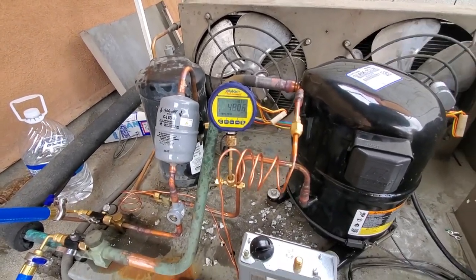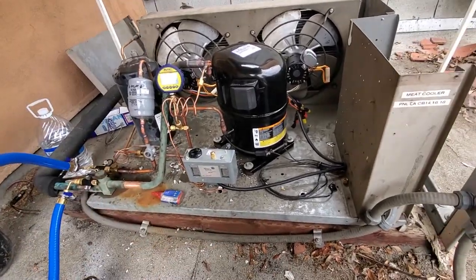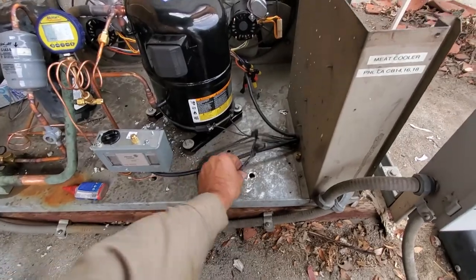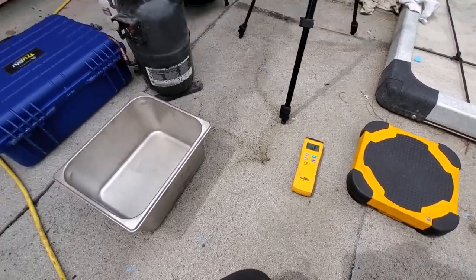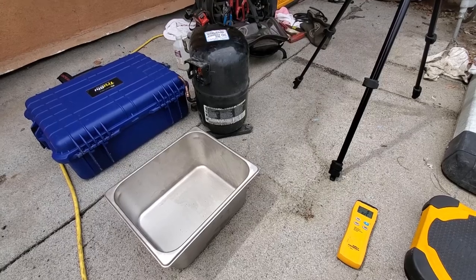We're just about where we need to be on our microns, and we'll do a decay test, but everything's looking good so far. We'll go ahead and get ready to hook this compressor up. And then, I'm just still cleaning up, but pretty much the unit's all ready to go and ready to start up. While I'm waiting for the vacuum to finish, we're gonna go ahead and pour the oil out of this compressor